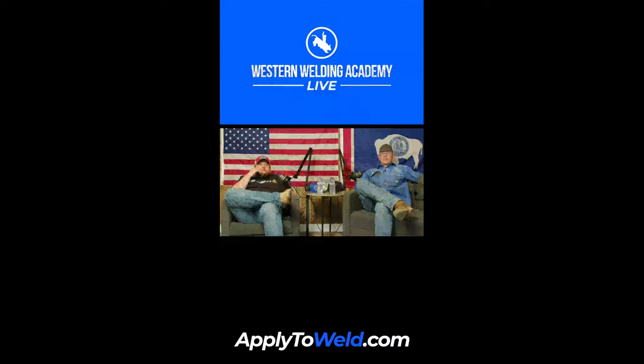We got the zoom now guys, so we can really pick you apart. Look at them ripples — we can measure them. A little stab-and-dab-and-run. I don't see any undercut on it. Down towards the beginning they start with a little bit of V's and then ripples, and then start smoothing out — finally got that heat rolling. Nice stop though, really pretty blue. I'll give that one a nine.